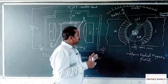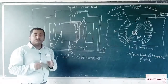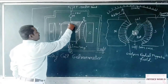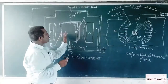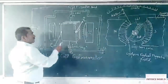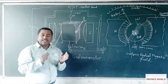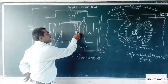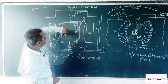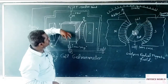When there is a current flowing through the galvanometer, this coil experiences torque and due to this torque the coil moves its plane with respect to the direction of the magnetic field. When current flows through the coil, there is a torque due to the two forces acting on the two arms of the coil. When current is flowing in the upward direction and the magnetic field is in this direction, the torque acts along the axis of the coil and tends to rotate it in the anti-clockwise direction.